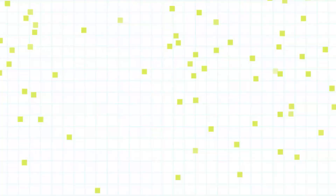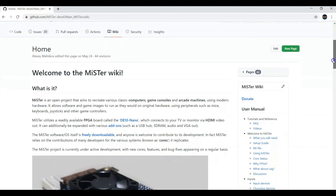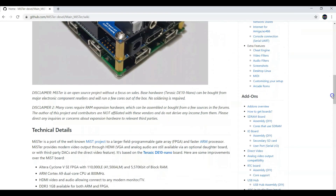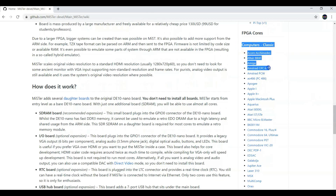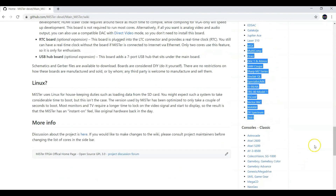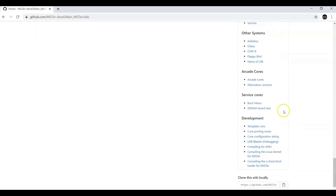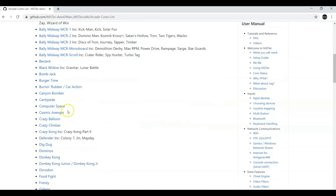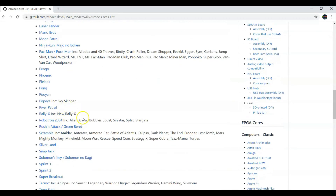Now let's take a look at the software available for the MiSTer. The MiSTer also has its own software package available on GitHub, and it has a large amount of systems it can emulate, including vintage and classic systems. If you're especially looking for vintage computer systems, I would definitely recommend the MiSTer, as it does those especially well all the way up to the 16-bit systems. If you're looking for 5th generation systems or later — such as PlayStation and N64 — the MiSTer might not be for you, due to the CPU limitations of the DE10 Nano board, which limits it to emulating up to about 4th generation systems such as Neo Geo.